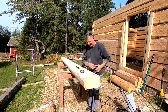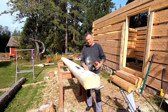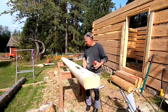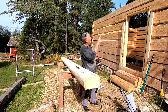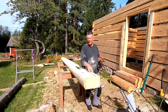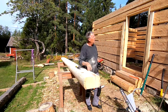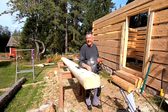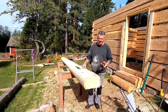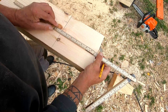Producing a lot of sawdust again. I'm ripping this one — I actually made this for the first log as an eighth round, but I decided it was going to be too high, so I saved it and I'm going to cut it down. Plus I need to connect the two plate logs in the front and the back with another plate log that has a dovetail at the end that is locked into the other plate log, so it locks it all together. Now ripping one side, I want to flip it and rip the other side, and I'm trying to figure out the dovetail notch I'm going to do here.